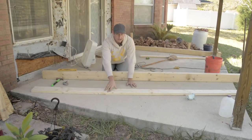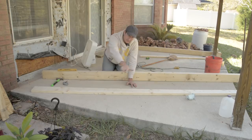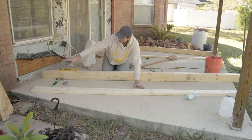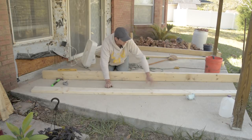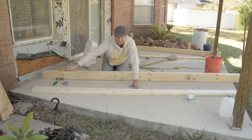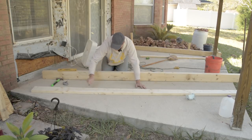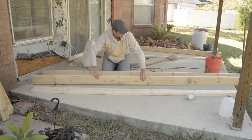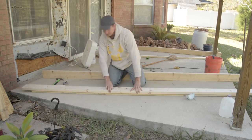This will be my outside form and I have a little bit of an elevation to deal with here. This is a porch so it actually slopes a little bit. That end happens to be the height of a two by six so that end is fine. Over here to keep the elevation level I'm about four and a half inches, so I need to trim about a half inch off on that end. I made a mark on that end about an inch and I'm going to taper all the way down, making a long angle cut. I'm going to use this as my straight edge and mark the line.